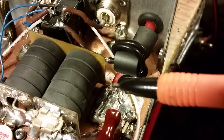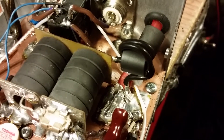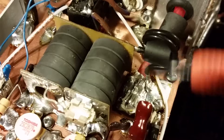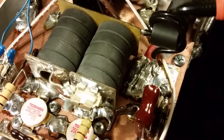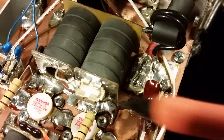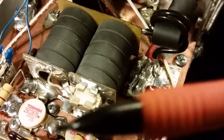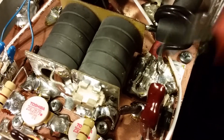Fatboy and X4 uses a lot of them — we use a 16-gauge wire on the choke to the transformer. Myself, I don't really even like going that small if I don't have to. I've been playing around with a dual B-plus type of flow where each transistor gets its own wire, so each transistor is kind of powered individually. That's what I've been kind of playing around with — it makes me feel better. It's extra work, but I like it.